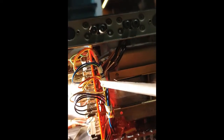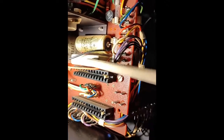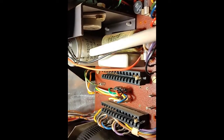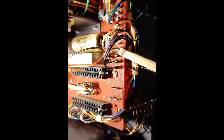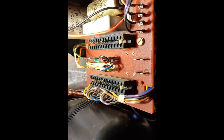Let's see those on the board. Here are the two wires for 27 volts — these are 22 volts AC. They go through this 2-ampere fuse, then through this bridge rectifier which is 2 amperes, then to this capacitor, and then to these plugs which are 27 volts DC.